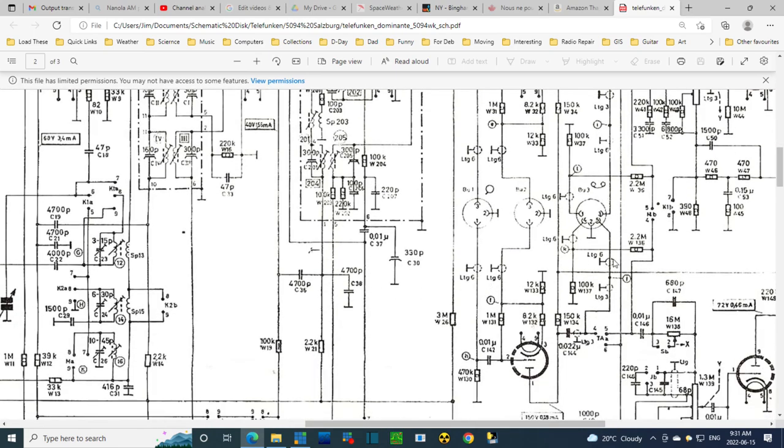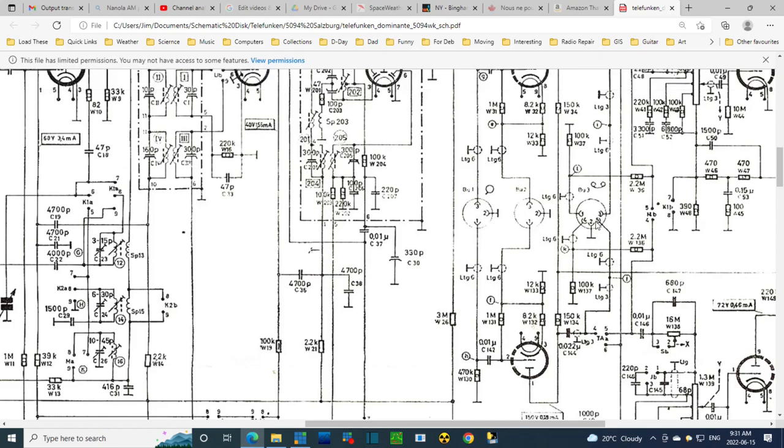Now, how can I be sure this is the connector? Well, it has the tape symbol right here. It also has five pins, and let's see how they're done. So, interesting. So here, the ground is in the middle pin, and then the two next pins are dealt with this way, whatever that means, and the other two pins are dealt with that way. Okay, let's take a look here. This is going on a shielded wire. Just to ground. That doesn't make sense. No, goes through here. 2.2 megohms. Ooh, that's a biggie.